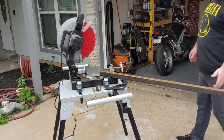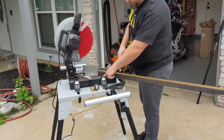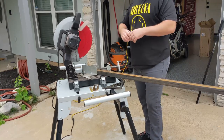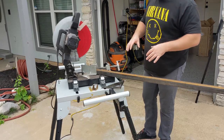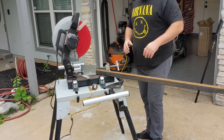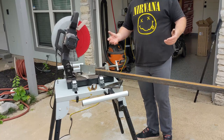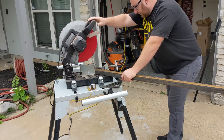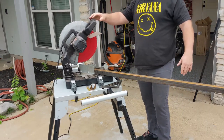Obviously, if you're cutting on a 45, the factory bracing doesn't work. I have this other stand — we're now locked in. I also had to move the saw forward because this stop was running into the piece of material. I cut 45s pretty regularly for frames and things like that, so this is not a weird corner case. This saw stand is really set up primarily for straight linear cuts rather than angle stuff — and that's not the chop stand's fault, it's not what it's designed for. But since cutting 45s is very common, having this secondary stand makes a huge difference. Everything is flat and square. Let's see what this cut looks like.